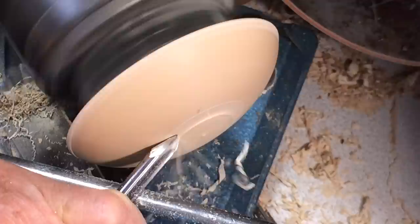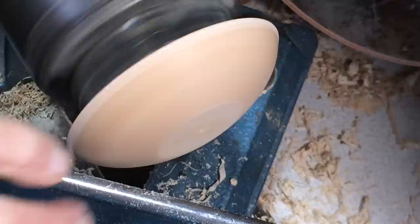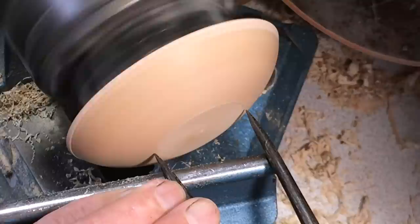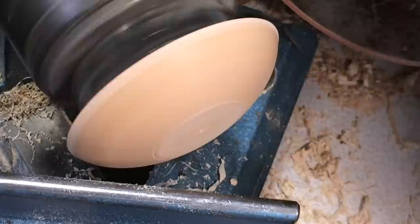I'm going to go for the larger one, which means I can take the bottom stuff away here. Using a 3/8 spindle gouge - and although this is face work, you can use a spindle gouge on it. Trying to work around the camera without touching it, so I want the center with a little bobble just between the two points. I'm going to mark that depth now, line the bevel up with the direction I want to go - which is straight in - and then lever the handle up, and that puts the edge in on the right line.